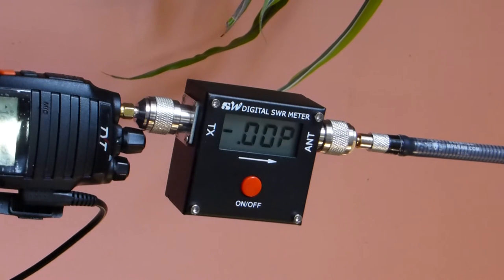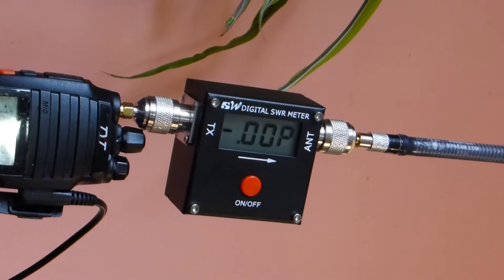Again, this will be the reflected power on the 160 megahertz antenna, and we're looking at 1.3 to 1.25 reflected power. Now, that is significantly different than the 5.2 that was reflected from the OEM antenna, and more than justifies the use of the dual wall heat shrink tubing, which has the significant velocity factor to it. But the overall advantages are apparent between using the tuned antenna and the OEM.